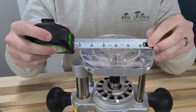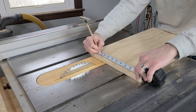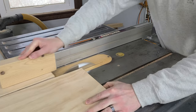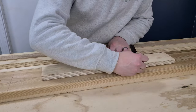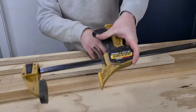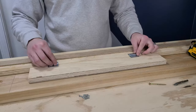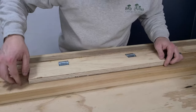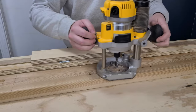With one simple trick you can make this guide even more efficient. Measure your router base diameter and divide by half — rip a strip of wood to this dimension as long as your straight edge. If you know where you want the center of your groove to be, place this strip along that line, place your straight edge against the strip, clamp it down, then remove the strip and you'll be perfectly positioned. To make this even more convenient, join the two pieces together with hinges so you have a quick reference spacer that flips up out of the way so you can route your line.